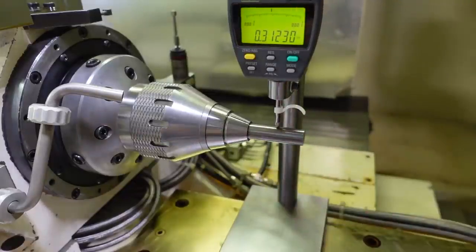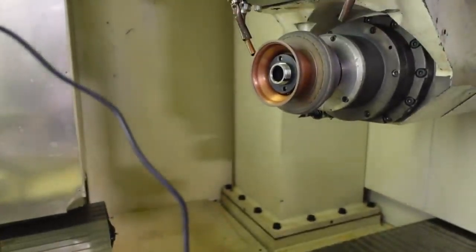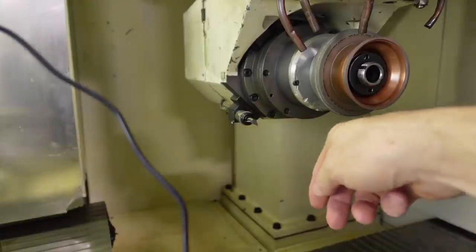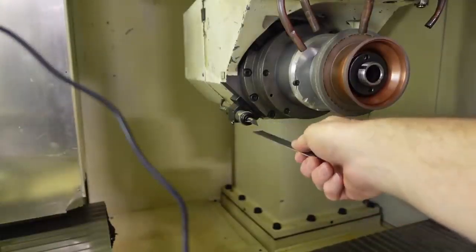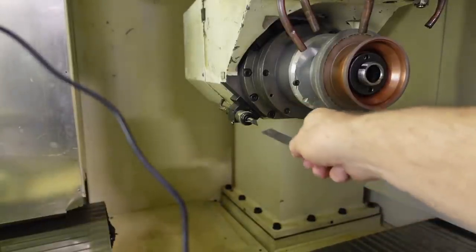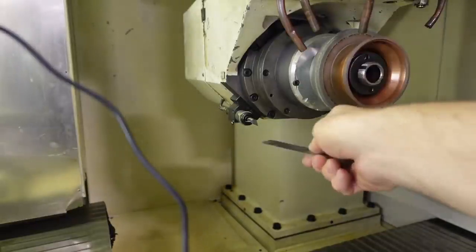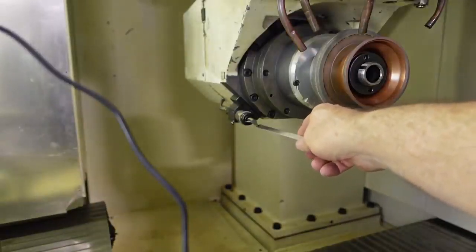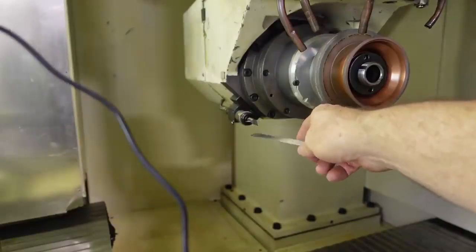Now, it is possible, if I look over this direction, let me jog the B axis. It is possible to measure with this probe and to measure the diameter, but for some reason in the cycle of grinding a new tool, they don't have the measuring cycle, and you'd have to run 2 concurrent files or programs, I guess you might say, to a regrind. In a regrind setup, you can measure the diameter, but for some reason the probing cycle isn't available to you if you're making a brand new tool, or maybe it is and I just don't know how to. If you hear that, that's the horizontal mill in the background. It's machining on the Inconel segments. But to go back to this, it is possible to measure diameters with this probe, as well as many other things, but